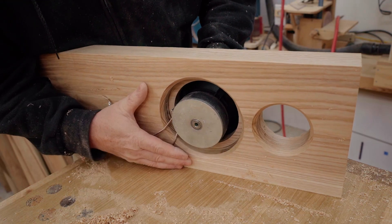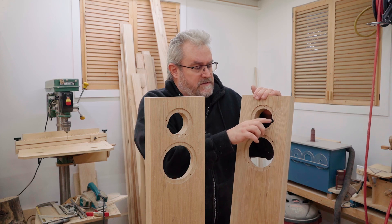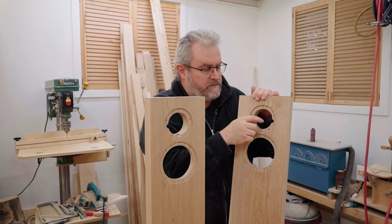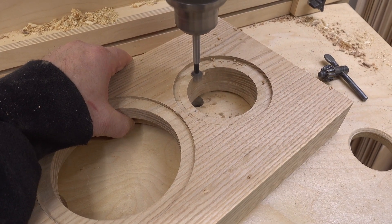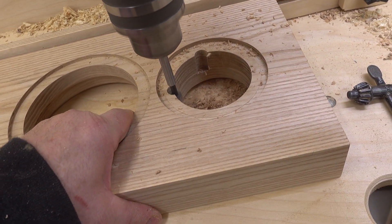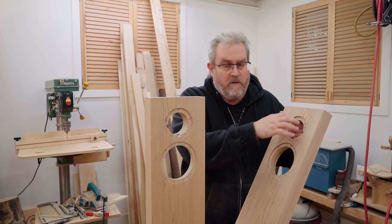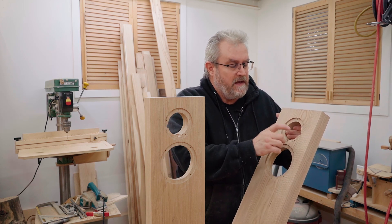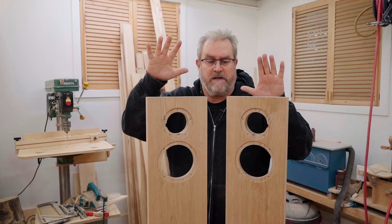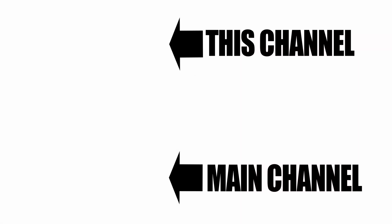I got the back sculpted out. I still need to do a little sanding in here to smooth everything out, but it is the back so I'm not going to go crazy with it. I also had to make relief cuts for the tweeter terminals — they wouldn't clear the hole — so I used a half inch Forstner bit. With that done, I took the drivers, put them in place, lined them up to make sure the holes are even side to side and up and down, then drilled out those holes to take number six screws. That's it for this one. In the next one I'm going to be starting to build the bases from that piece of cherry I planed earlier.